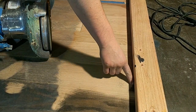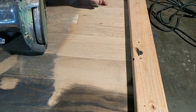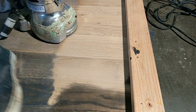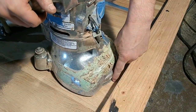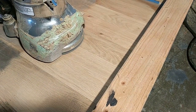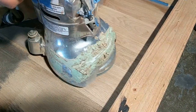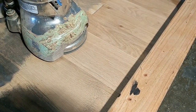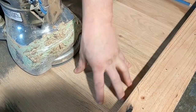To recap: go slowly along the base but not too slow, then go over it up and down — also not too slow, and not jumping too far ahead. Make sure you get that nice cutting action. If the edger is only cutting half an inch on each side, go up and back down in the same area, then move over a half inch so you're still cutting — about a half inch to three quarters or even an inch — whatever gives you perfectly flat results.